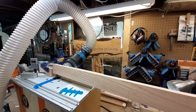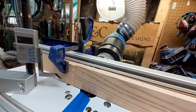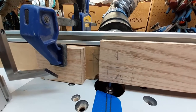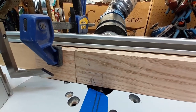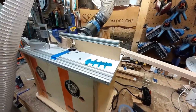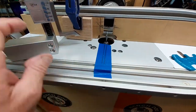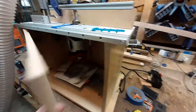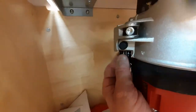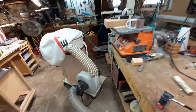The basics of router setup: you're going to want a stop block. Basically you're going to drop your piece in at the left end and then very carefully go toward the stop block, and then it's going to be the same every time. A practical tip is to run a piece of tape with lines showing you where your bit is, just in case. This is the bench dog — I have a Skil router in there. This is nice because you can adjust its depth by this knob here and go up incrementally. You definitely want to have dust collection because a lot of dust comes out of there.